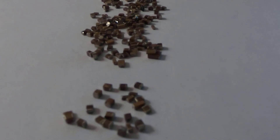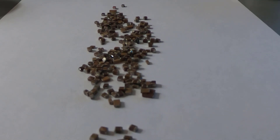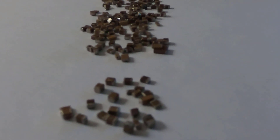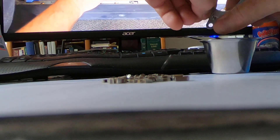Alright, so here you see a line of MLCCs, and this will be a mix of the noble metal electrode or precious metal electrode and base metal electrode type — or magnetic, non-magnetic type. We're going to go ahead and run a magnet over them. In the background there is e-waste Ben — that's his latest scrap marathon episode. I'm going to take my neodymium magnet here. That's about a quarter inch leg, so this is about a quarter inch above. And as we get close, you see the MLCCs jumping right up there. And then every now and then I just take and drop them off into the magnetic bucket.